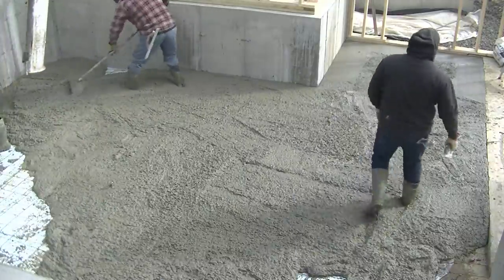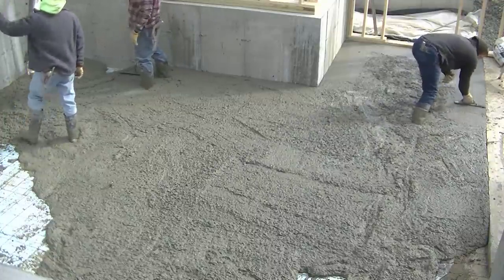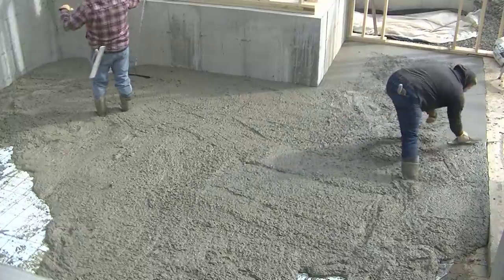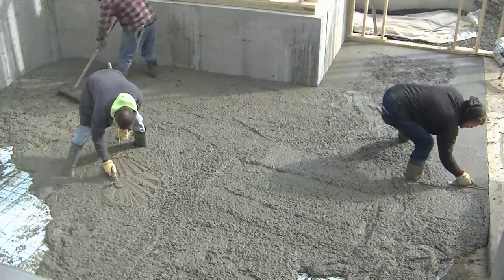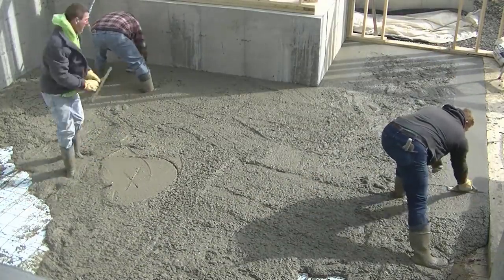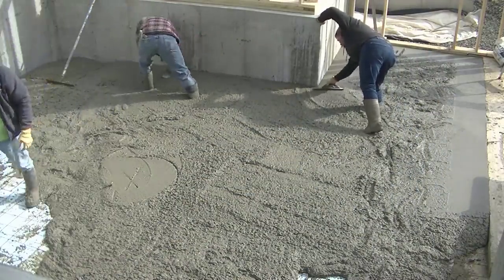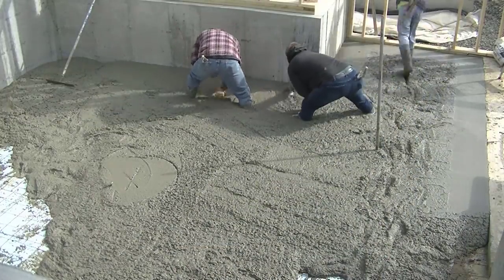The temperature, like I said, was about 20 degrees this morning. The driveway coming back down to this was frozen solid, which was a good thing because a couple of days before it had rained and it was so muddy there's no way we would have got a concrete truck down there — we would have had to use a pump truck. So being frozen actually made it a little more convenient, saved a little money for everybody. You can see I just made that center pad using that metal pin with a nail through it, and we'll strike off that for the floor.